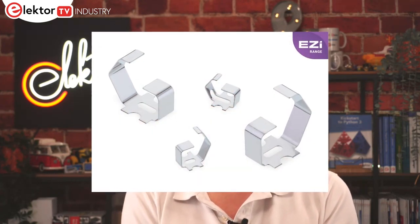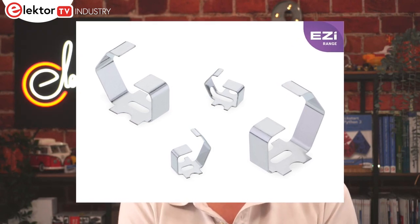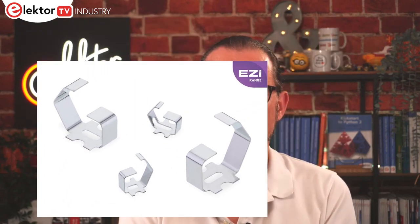Connecting printed circuit boards can be a challenge. Most sprung contacts support vertical compression, but parts that provide horizontal movement are few and far between. Harwin changes this with a new range of spring contacts that support multi-directional operation, providing designers with more flexibility in their high-density designs. The S1921 and S1931 offer heights of 4 and 5.5 millimetres respectively, while the taller S1981 and S1991 offer 8.5 and 10 millimetres.